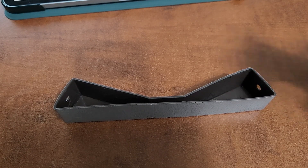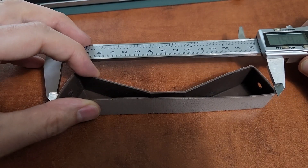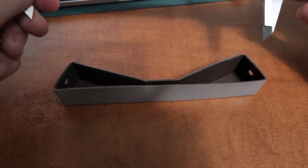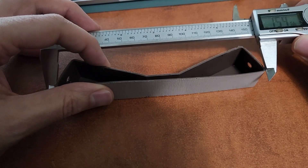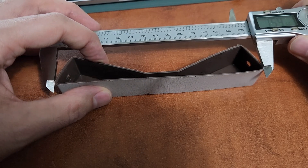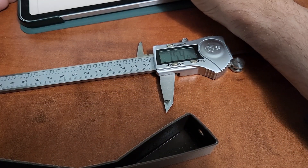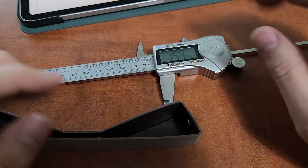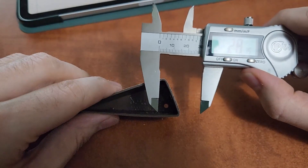The first thing we're going to do is take the outside dimension. It's just a bit too big for my calipers so we're going to have to kind of just assume. This is 154.6 and I think I'm just going to do 155 — I think we'll be totally fine. We can always increase that later on. So 155 millimeters is our bottom measurement. And then I'm going to measure how far in this peak is roughly.